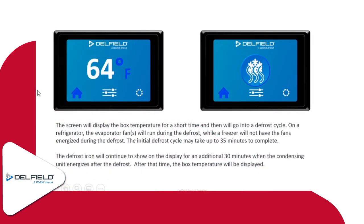So upon startup, normally it'll flash the box temperature, usually for about 3 minutes or so, and then it'll go into a defrost cycle. The refrigerators will have the evaporator fans running during defrost. The freezers will not. That initial defrost cycle on either unit could take up to about 35 minutes before it completes. That defrost icon will show during the entirety of the defrost, and then for an additional 30 minutes after the defrost is over and the unit begins into a cooling cycle, it will continue to show the defrost icon on the screen. After that 30 minutes is over, then the box temperature will be displayed.